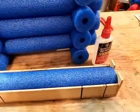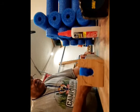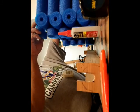Then go to cutting on the back side. Go ahead and just cut across the line like that, and take my blade and cut through there like this. And then on the second pass, I go over there and I connect up to the other side, and then you just pull your piece out, toss it in the trash. Then the other side, got your 2 marks, make your little saw mark into it, turn it around, and cut back to the other side of the corner, and then you can pull your edge out. And then put your finger in there, pull it out, and you got a nice Lincoln log for your Lincoln log set.